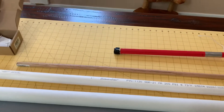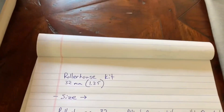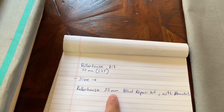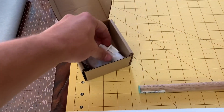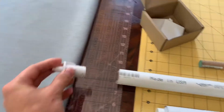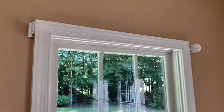About once every three months I have to plug these in and charge them back up. It has a little antenna line that connects to a remote. I would suggest if you're doing multiple windows that you buy one kit — that is a Roller House 32 millimeter kit, which is actually 1.25 inches. The blind repair kit comes with the brackets and a little nub that goes on the other side of the pipe, plus two brackets.